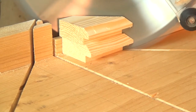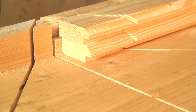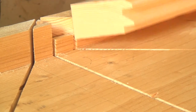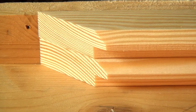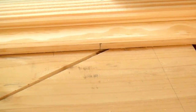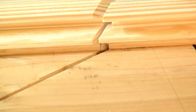Now it's time to start to cut the molding to the final size. First of all, I've cut a 45 degrees corner. After marking the point where I need to cut the molding, I went to the miter saw and I've then cut the two opposite sides together because they must have the exact same size. I've cut the molding slightly larger, so the aluminium panel will have a bit of space for when I need to put it in the frame.